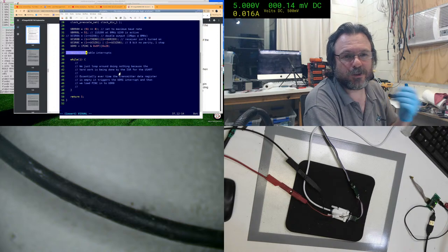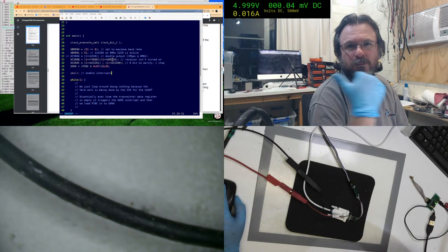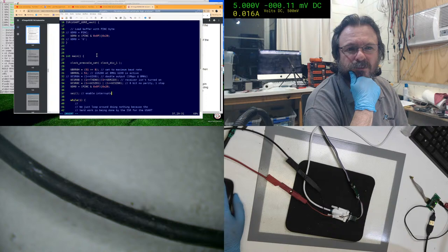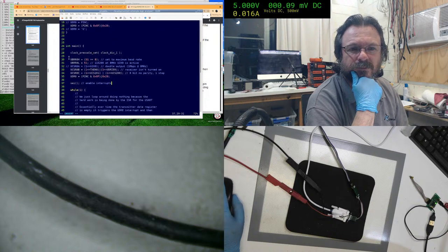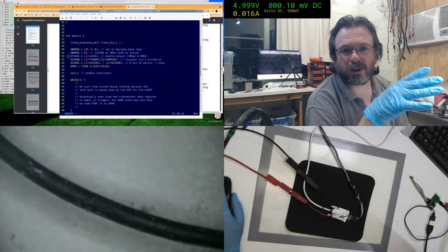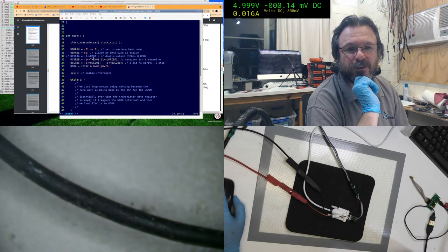No, while the original circuit was event driven, the serial output still... you know, once you sent that byte to the output, that was it. And the fact that the data is coming out with the high nibble set at 2 means it must be doing it right, because if it was a mistiming issue or anything like that, then that would get mangled.